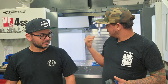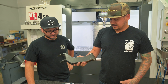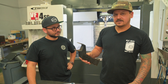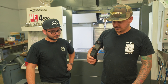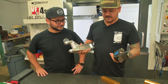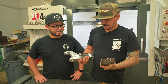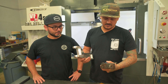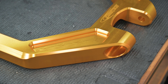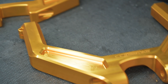This is what our old steering swinger used to look like after being on a truck for two years and never coming off — never had a failure. But I always wanted to do them in billet, so you actually save a bunch of weight, keep the precision way tighter on tolerance, and it's just a lot stronger too. You can see these areas are just a lot bigger. That's another advantage of having these in-house — being able to update and change the way we do things.